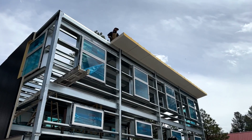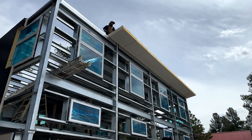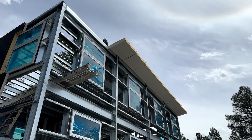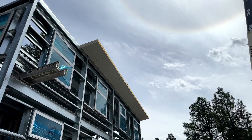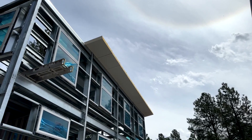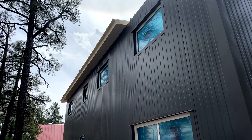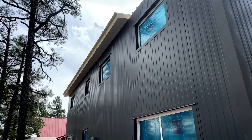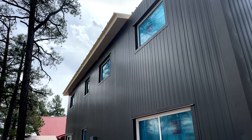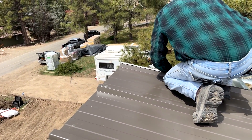For the Vesta kit house, the south-facing roof overhang is designed to create shade over the upper windows during summer to keep the house cool, while allowing sunlight into the house during winter when we want the sun to help heat the house. The rear overhang is on the north side, which doesn't get direct sunlight, so the overhang on this side is for style, as a connection point for the gutter, and to keep precipitation off the north wall of the house.